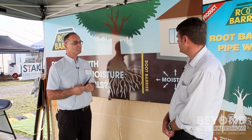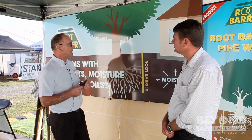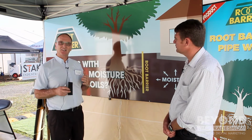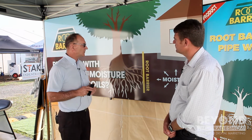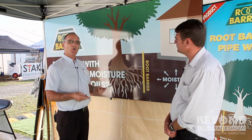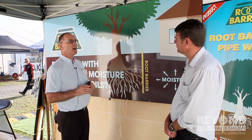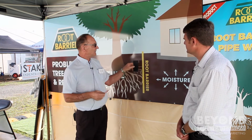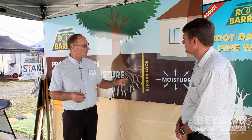So Alan, what is it that's really unique? In a couple of points, what is it that's unique? The barrier itself has a 700% elongation. That's key. If there are others that have tried to do this work with more brittle materials, whether they be plastic or concrete or other, your imagination goes rampant. But if it doesn't have the capacity to stretch and to store, it will fail simply because of the head pressure.